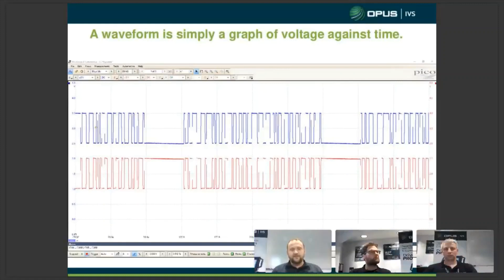Now the graph has two axes. The Y-axis going up is the voltage, or the unit of measurement we're going to be looking at. And along the bottom is the X-axis, which is time. These can be adjusted as well — you can zoom in to see a very small part of the signal, or zoom out to see a bigger picture of what's going on.